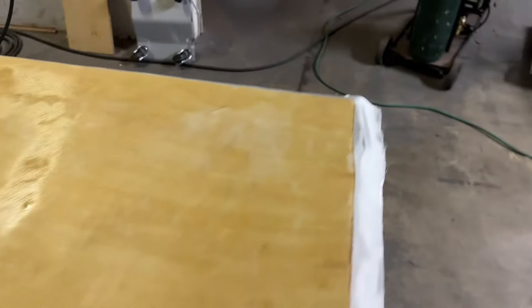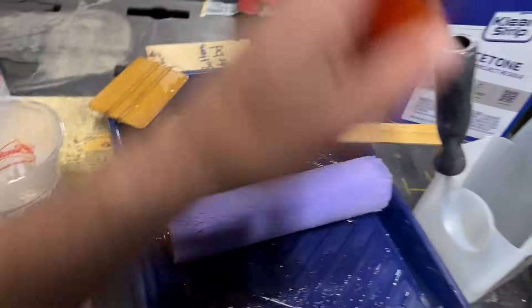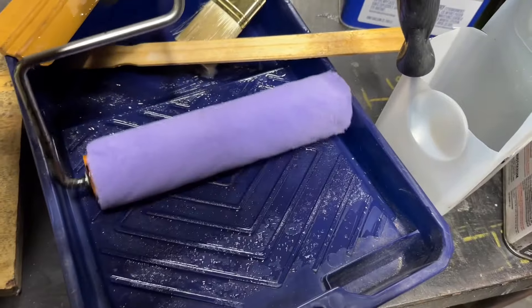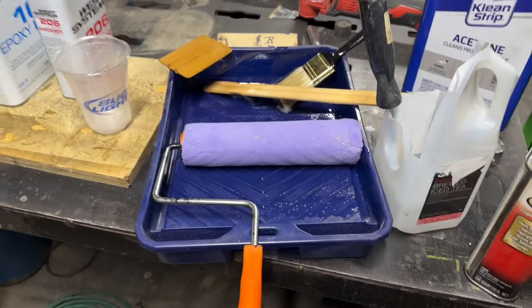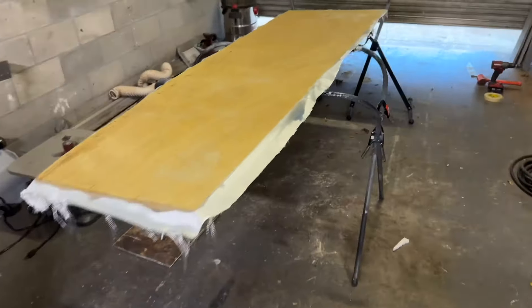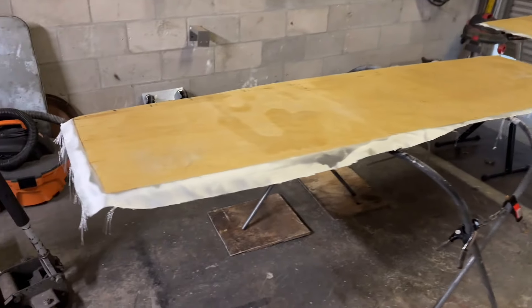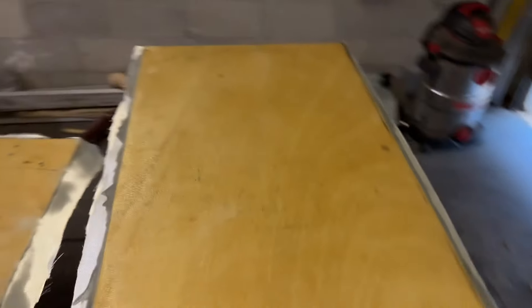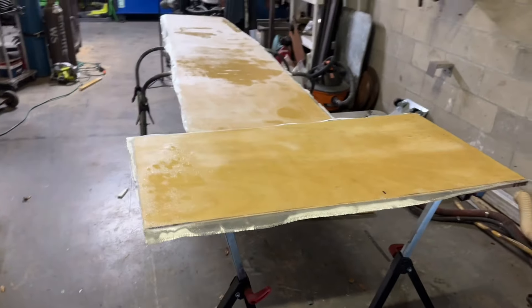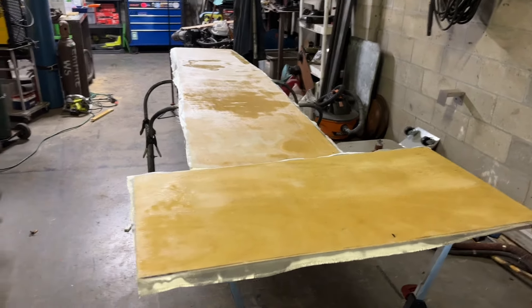The roller was definitely a learning curve — don't really know how I feel about it. Like I said, it just holds that epoxy resin in there. Maybe if I had gone in with 20 or 30 pumps — a real heavy batch — wet that guy out and then started rolling it and dunking it back in, it may have gotten pretty wet. But at that point I kind of feel like I'm wasting it. I'd rather be a little heavier on the epoxy side than too dry, so that it doesn't void and doesn't peel up. But I guess it's just a learning curve.